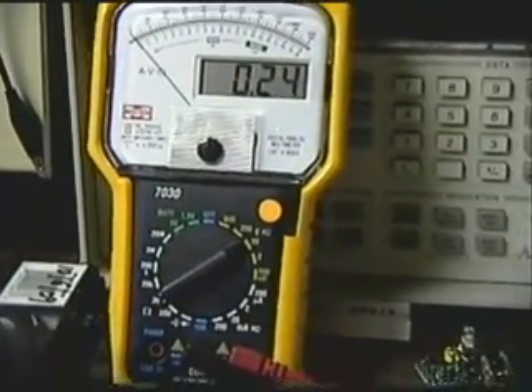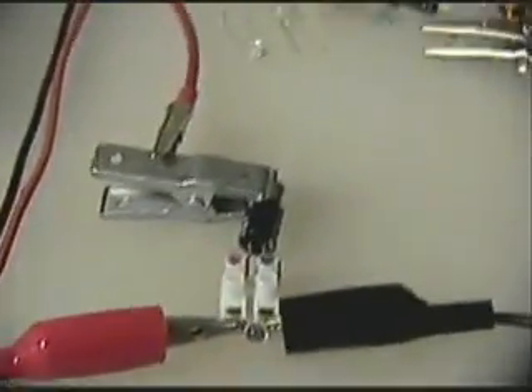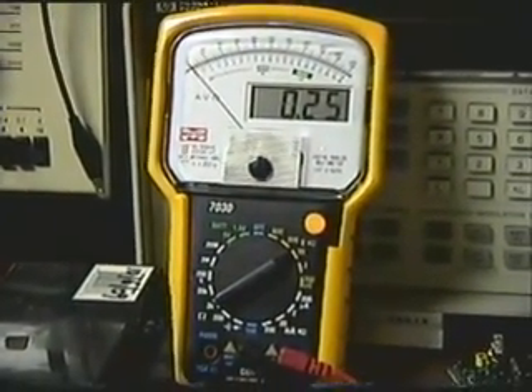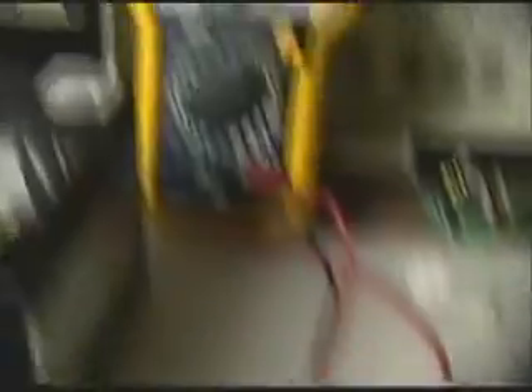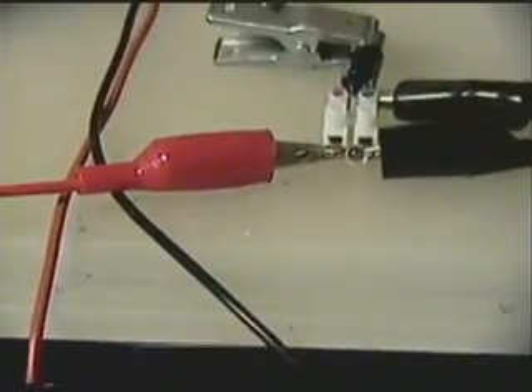I have the red LED installed now. I'm not going to short that capacitor out, but it's continuing to drop — measuring 0.23, 0.22, still continually going down. I'll go ahead and hook that negative lead back up again. The negative lead is connected — I have nothing out of the red LED. The capacitor is reading 0.25, 0.26, and it seems to be holding for a while. It went to 0.27, but we're not seeing a rapid charge or discharge, and I have nothing coming from that lower voltage red LED.